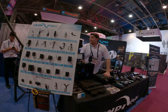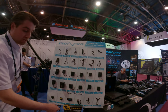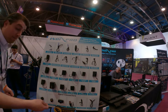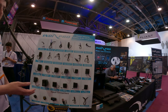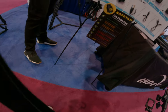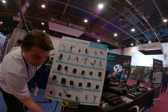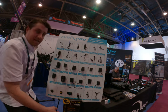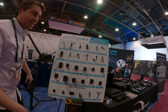These are safety taps. We sell a lot of them to rental houses. People use D-taps to batteries. Basically, if you plug this into a battery correctly it lights up green — everything is good. But if you plug it in backwards, it lights up red and stops any power from coming out, protecting your equipment. It's supposed to be flashing all different colors — purple means it's getting too hot. The battery is disabled. It has all these different processor trips in there. So it's a D-tap on steroids.